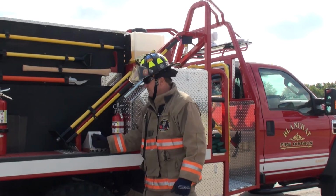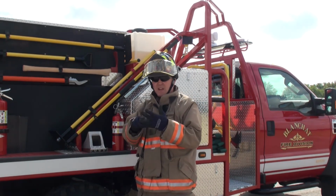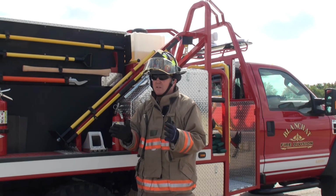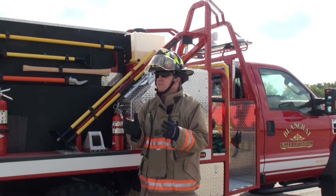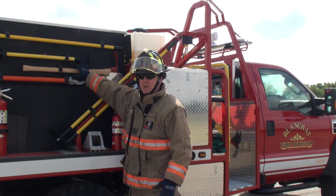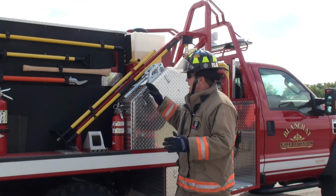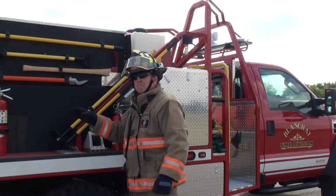An around the pump foam injection system, to install one on a truck, by the time you buy the system, put the tank on and plumb it, is around $1,000. My recommendation to you is save your $1,000, put your $1,000 in equipment on the truck or something else, or in compartmentation, something that's going to be beneficial. And then go buy some quart jugs and batch mix it.